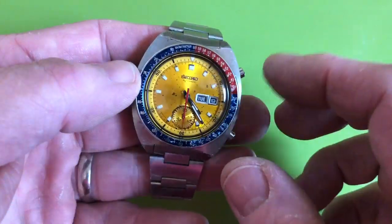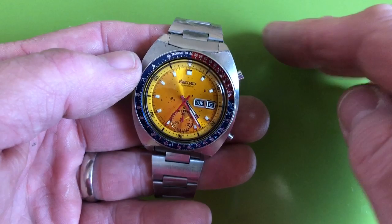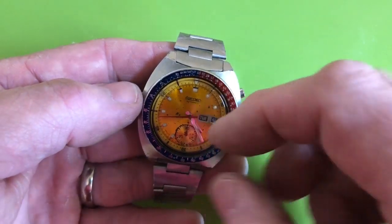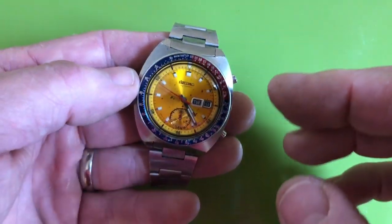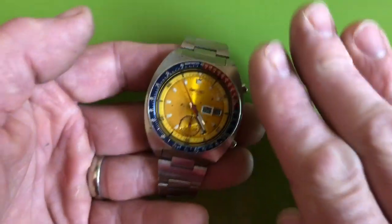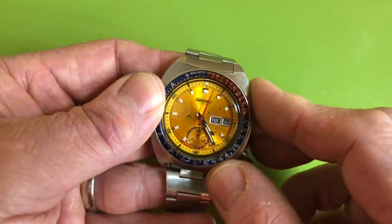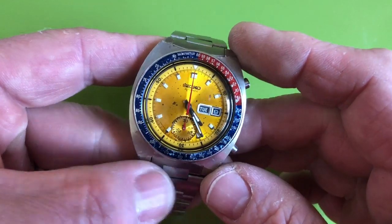properly. The internal sealing surfaces straightened up a lot better than I thought, because how I worked with that is I have a staking tool, and think of it as a tiny little anvil and press together, and I was able to use it with a little teeny tiny jeweler's hammer. I was able to get that metal to stand back up again, a lot of it, and then I took off the excess and the warp, and then again I took down the face like so with my Japanese water stones, which is kind of like a grinding stone. I use it for like sharpening planes and knife blades and things like that.